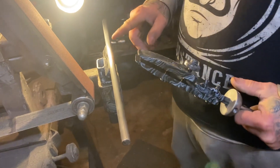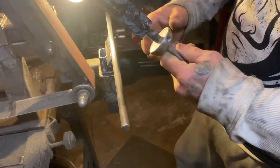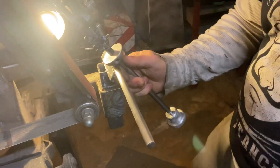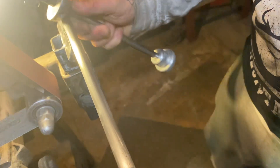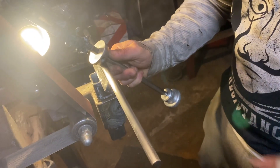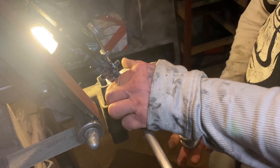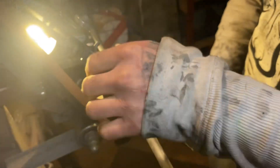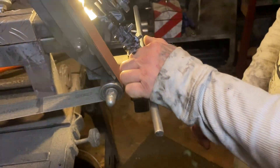The tool rest — just a cheap little fixed rest for small knives, but I'm going to make a real longer one. When you're sharpening, going back and forth, you hold your finger on there to keep it flat and run across there. If you want to go with the curved edge, you rock on it. You can hold it like this with the handle here and slide it and curve it, or you can hold it by the knife handle — it's all up to you. That's what the knob's for: hold it here with the rest and go back and forth when you're sharpening.